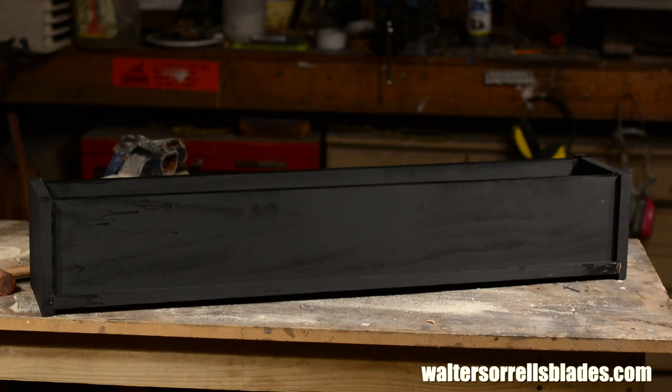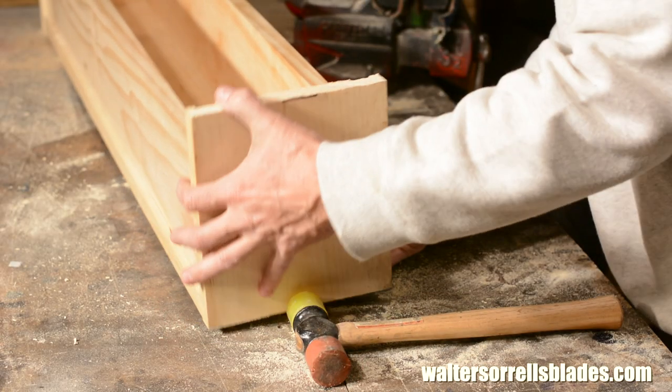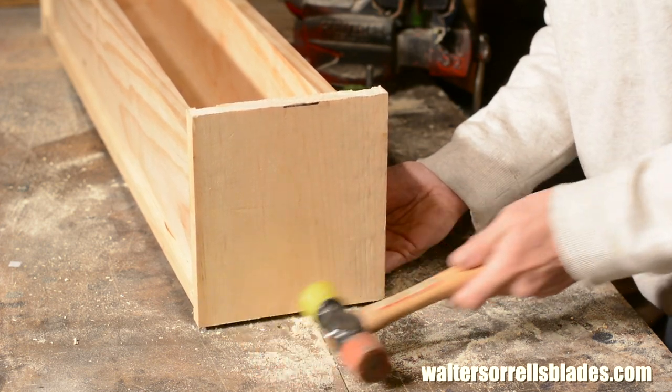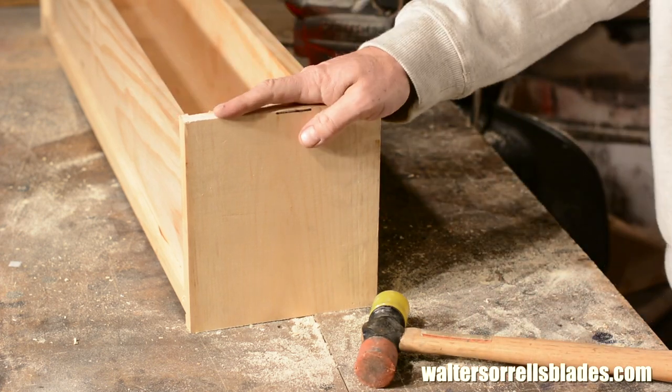In this video, I'll show a small quench tank I've made recently for quenching knives in. Of course you can use plastic vats, PVC pipe, and so on, but I came up with this because it exactly fits my needs and it doesn't cost a ton. In fact, this whole project cost about 35 bucks. The tank will be made from wood. The problem with wooden quench tanks is that they expand when they get wet. Even if you seal them with caulk, they're prone to leaking. So this tank has many small design features designed to ameliorate that problem.